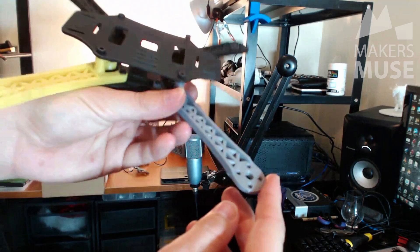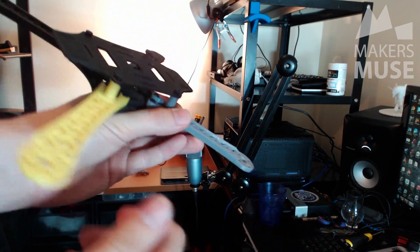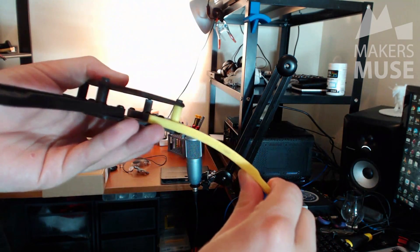The gray arm is PLA. PLA is pretty stiff — if you watch my previous videos, I mention it's quite brittle. That's usually the case; there are some strength-modified PLAs, but in general it's pretty brittle but fairly stiff. Then we have ABS. ABS is fairly tough — it's not as stiff as PLA but it has a bit of flex to it.